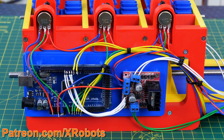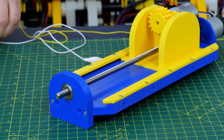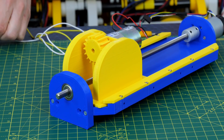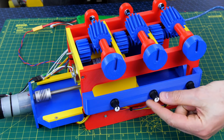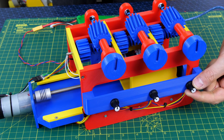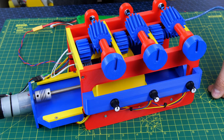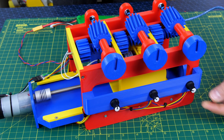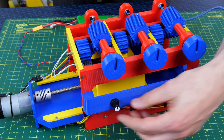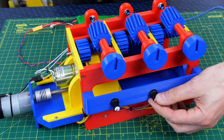I used an Arduino to control this which read three analog pots. The code running on the Arduino would move the motor to try and match the output with the inputs. I had various logic built into this so that it would prioritize the largest difference between input and output on each channel. However, this meant that it would cycle through each of the outputs making each one a tiny bit smaller until another one had a larger difference between the input and output, which wasn't very efficient.